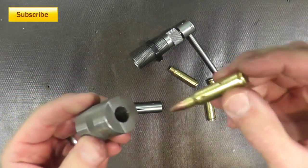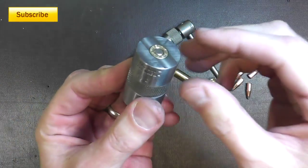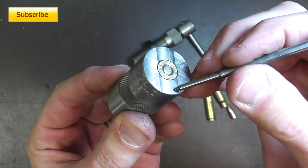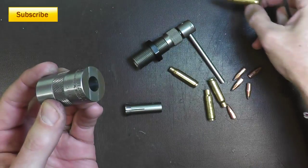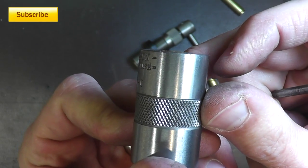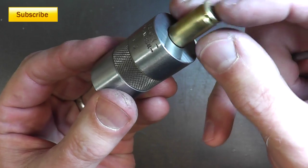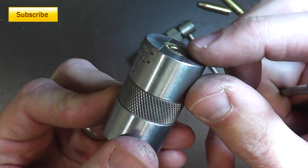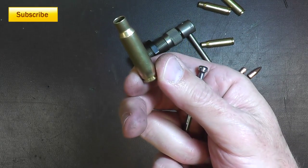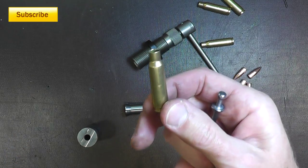I have a case gauge and this is what really threw me off — I dropped the rounds in the case gauge and they seemed real nice, real good. It's flush, but it needs to be flush on the bottom side right here where the firing pin is, not on the high side. If I take one that I haven't resized, see how it's raised up just a hair — that's all it takes apparently. After resizing, it's nice and flush, going just below the top — good brass. All it took was to screw that resizing die just a little bit further down. Even if you think you've got your resizing die down far enough, go another quarter to half turn.